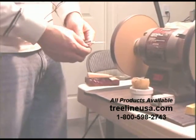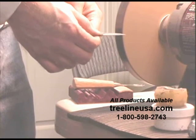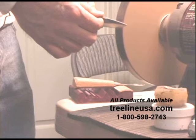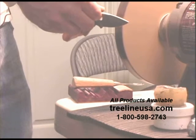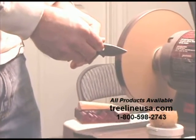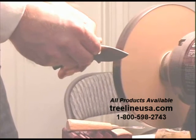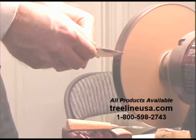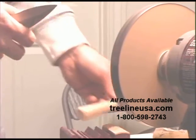The next step is trying to find the proper angle for your knife. If 90 degrees is perpendicular to the wheel, half of that at 45 degrees is where you would sharpen hatchets, axes, and different things. Halving that again to around 22 degrees is normally where you'd sharpen most of your pocket knives. Carving tools can be sharpened anywhere from around 18 to about 20 degrees. Normally, if it's a good quality blade, follow the manufacturer's bevel that's already been placed on the tool.